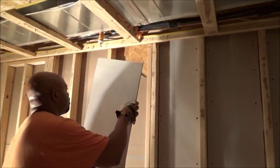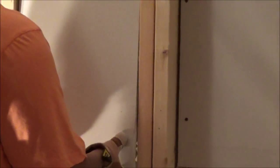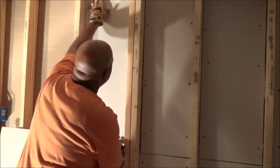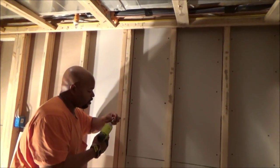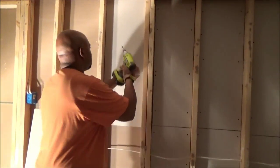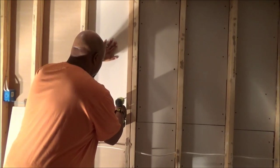I'm going to fit it in here — slide it up a bit, all the way up to the top, press it in. There we go, a nice solid fit. Now that we're here, Donna, would you mind passing my drill? When you have it up like this, usually all you need is one screw to get it settled. Just switch it around a little bit left to right so the glue settles in there. Load up just one screw, place it in. That should be enough that you can let it go and load it with your other screws.